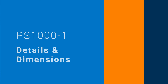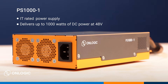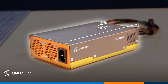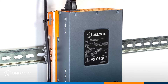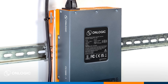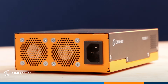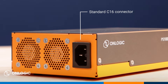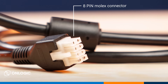So I happen to have one on my desk. Let's take a closer look. The PS1000-1 is an IT-rated power supply capable of delivering up to 1,000 watts of DC power at 48 volts. The dimensions of the adapter are 7.87 inches by 5 inches by 2.4 inches. Your included mounting accessories support wall and DIN rail applications, as well as rubber feet for sitting it flat on a desk or a shelf. The connectors on the supply are your standard C16 for your AC inlet supporting 100 to 240 volts, and an 8-pin Molex connector on the DC side which can be adapted to fit any number of terminal block power options.